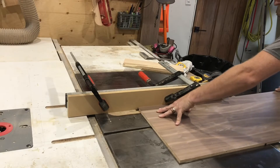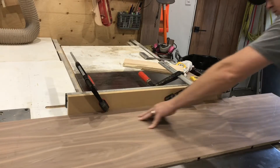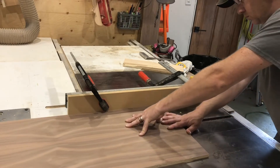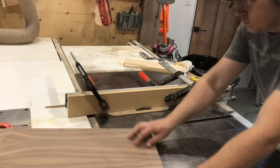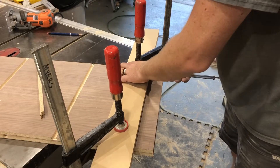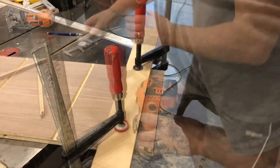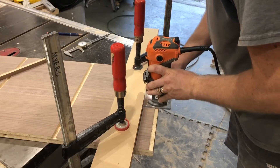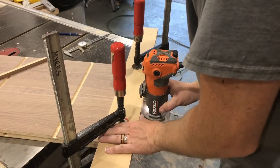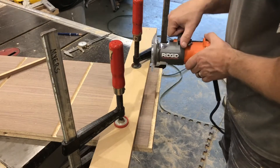This is where the panels become unique. The left and right sides are both getting a groove on the back side — one groove in either of them, but they're opposites, mirror images. I'm using the same half-inch dado stack, but I've added a sacrificial fence because I don't want it to rub up against the metal fence — that would obviously be dangerous. For the groove on the top of these panels, I couldn't do it on the table saw, so I'm using a small router with a half-inch spiral bit, which does an exceptional job.